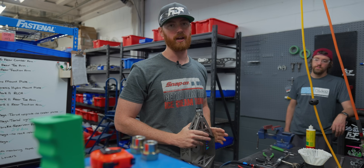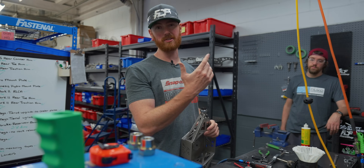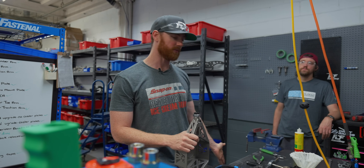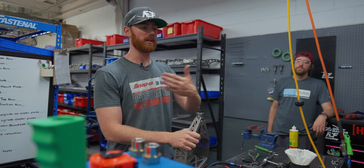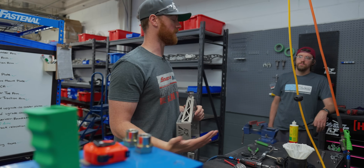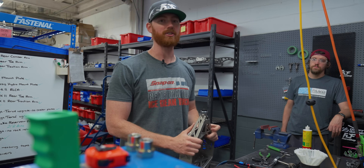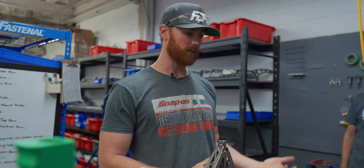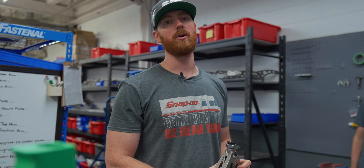The key to the robo arm and the clamp is obviously a safety factor. You're going to have 600 pounds of force — which I calculated with the cylinders and can show you in the computer — so you can't get your fingers in there. We also can't have steel on steel, so we'll have to create a Delrin pad or a 3D printed plastic pad that's replaceable, so we're not marring up parts or creating a shear point. Incorporating a safety factor is priority number one, and then the efficiency plan is what we are here to solve.